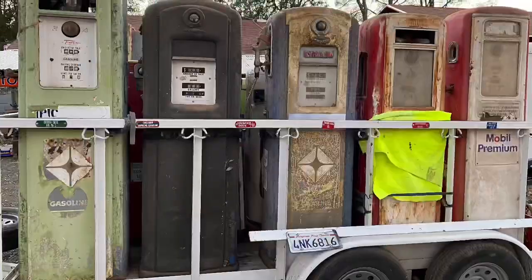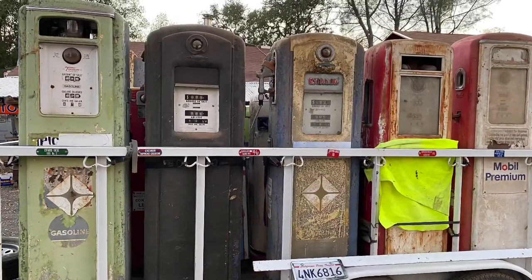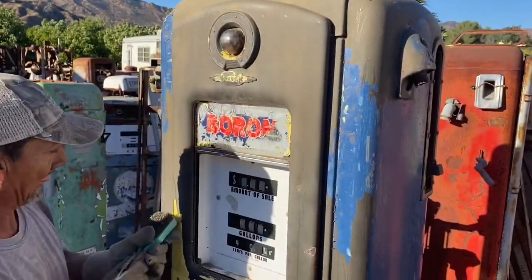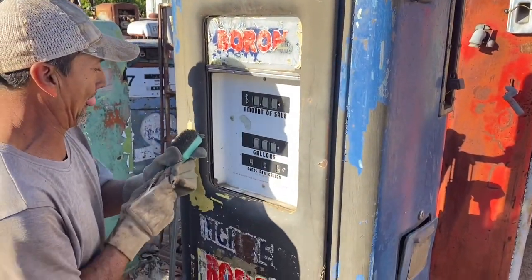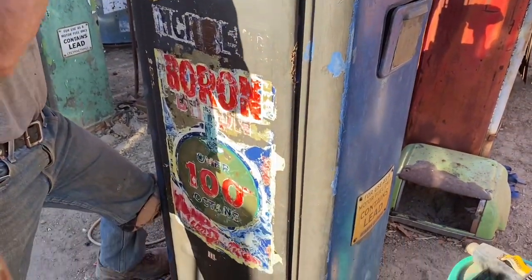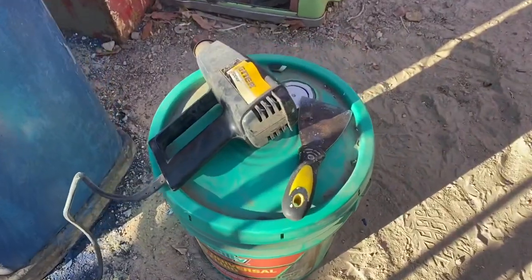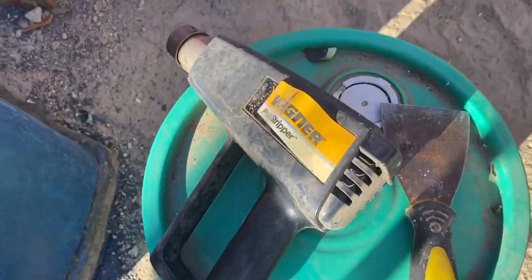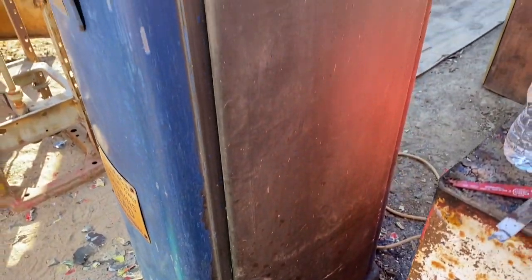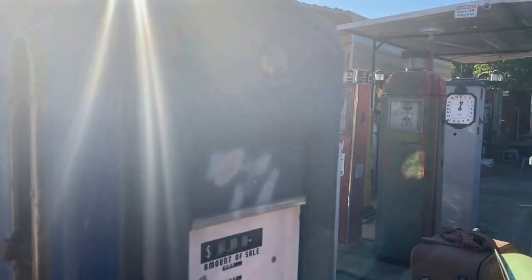This is just one approach. It depends on how thick the paint is, what approach you would take. This is my friend Antonio scraping paint off the old Bennett. We also used a Wagner heat gun for part of this process, but what you're looking at here is about 2 hours after we started on this pump.